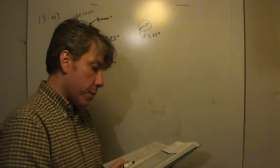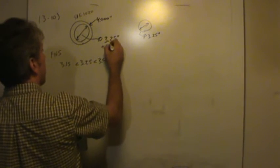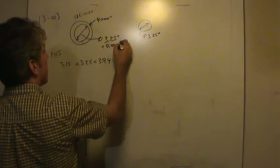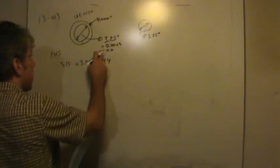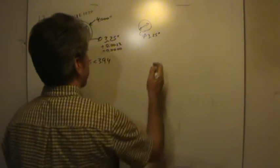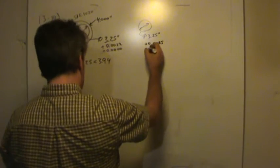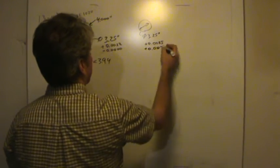And so there the standard limits for the hole are plus 2.2. So the hole plus 2.2, and this is thousandths of an inch. So really you could write it this way, plus 0.0022 all the way down to plus 0. That's the lower limit. And they say minus 0. In other words, no less than 3 1/4 inches. And if we're going to use 4 decimal places in the previous, we should there as well. And for the shaft, it says the shaft should be oversized by anywhere from 7 thousandths all the way up to 8 1/2 thousandths, which is the high end.